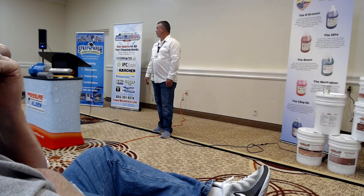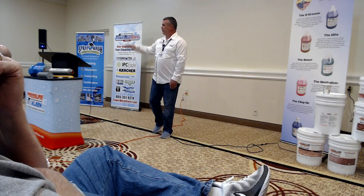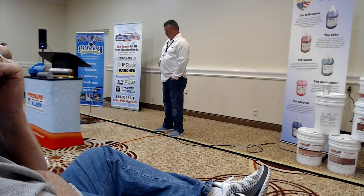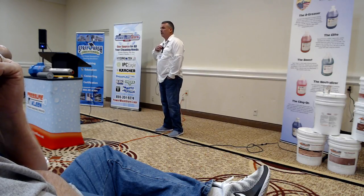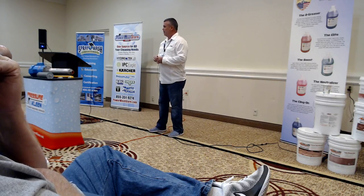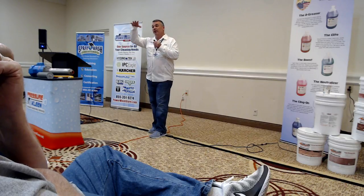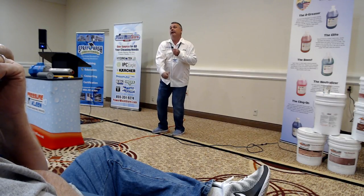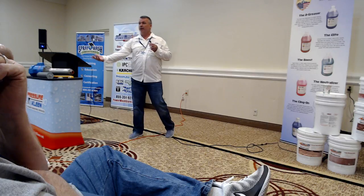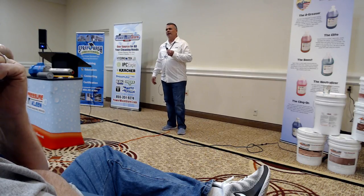Something else too, I'm talking about priming. Once it is primed, they're actually very good about holding prime. We've done some fences in neighborhoods, like a PVC neighborhood HOA fence. We'll prime these things in the shop, drive 5 miles to the project, fire it up, and it's still holding the prime. But if it's above the tanks and you have air leaks, it's going to drain back down into your tank, and then you have to get it back up. If it's underneath, once you have a prime, it'll drain your tank out, just pulling it through by gravity. So putting it in one of Paul's boxes on a fender or on a tank would be fine, as long as it's not above the tanks.